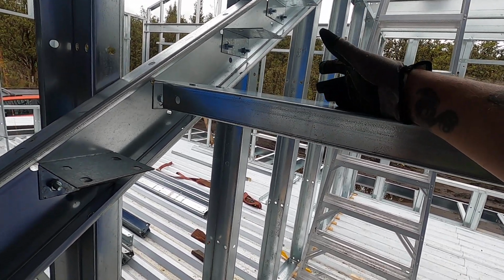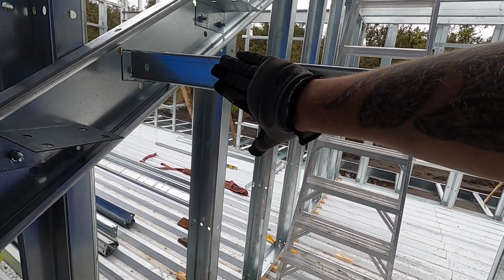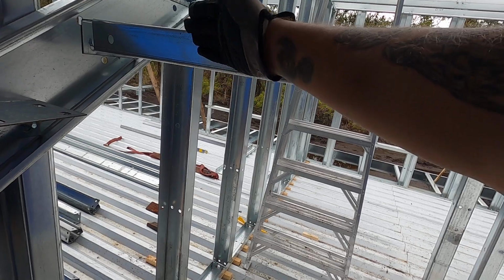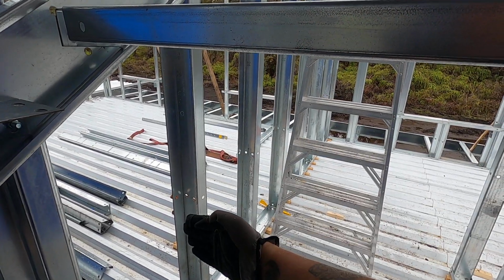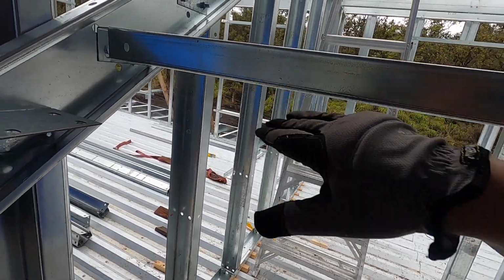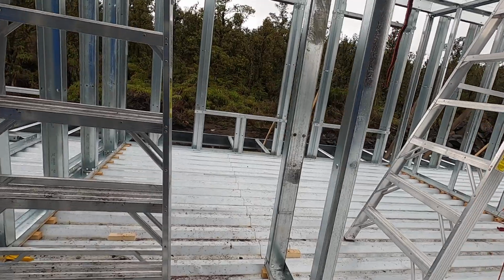And then when we get everything done, we're gonna come back in with the 12 inch, I think it's actually 11, but 12 inch by 1 inch thick bullnose. And then we'll strip some plywood and come down. So we'll have a face here at the plywood and then the 1 inch bullnose over the top of it.